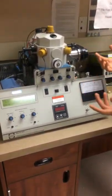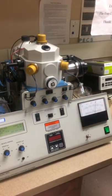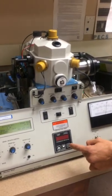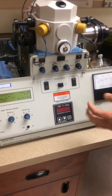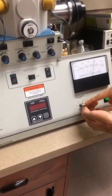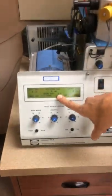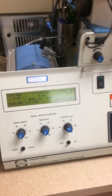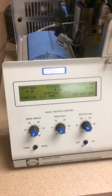Let's say the 20 minutes have passed. Now we can turn the guns on. Click this start button right here. This is your beam energy — the voltage of the beam. You want to turn this up to about 6 volts. The voltage here shows zero right now, so I'm going to turn this knob and you'll see it change to about 6. All right, it's turned to 6.